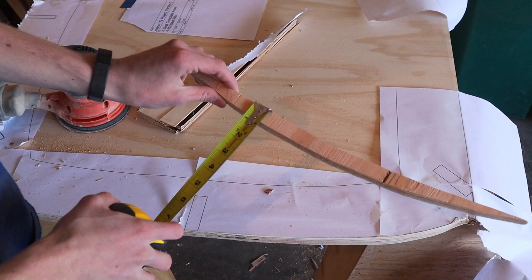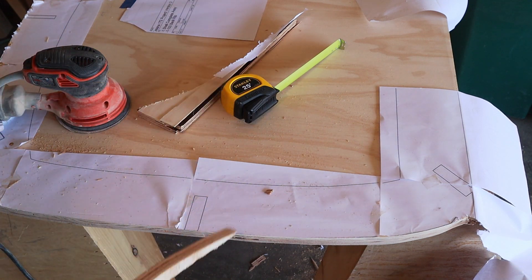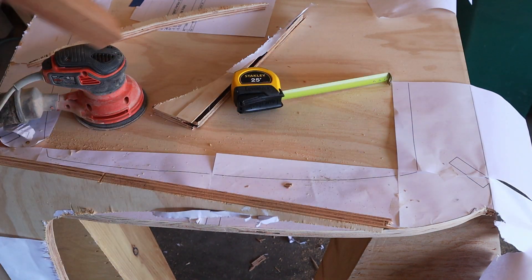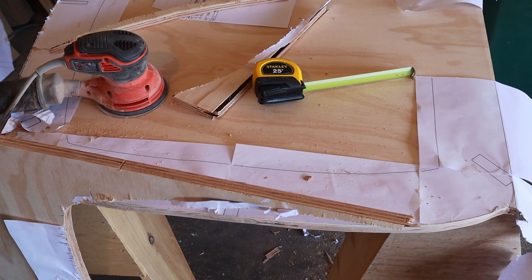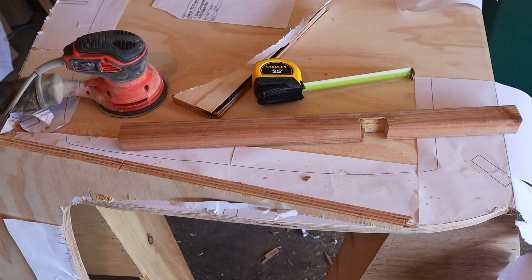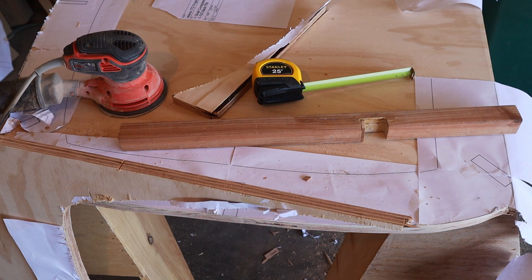That's making me wonder if I can go from 2.5 down to 2 or even 1.5 inches. This right here is three-quarters and it fares okay. I want to do a test with a 2-inch stringer. 2.5 was honestly quite an arbitrary number. What I'm going to try now is taking a 2.5-inch-wide piece of wood from this plywood that's 24 inches long — that's how long the assembly will be. I'm going to try first with some OSB and then if the result's not good, I'll try with normal plywood.